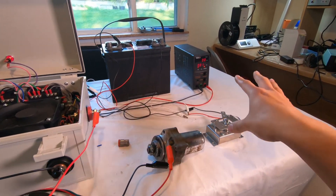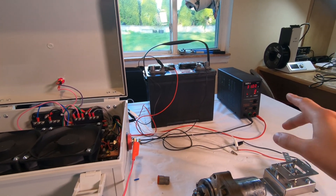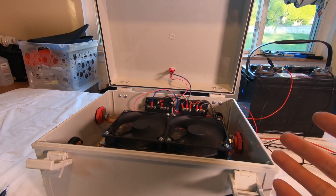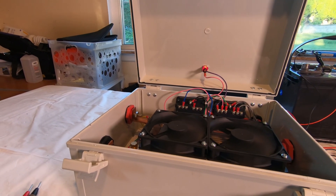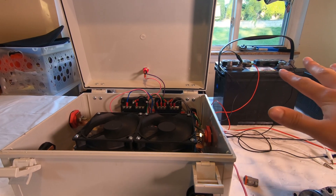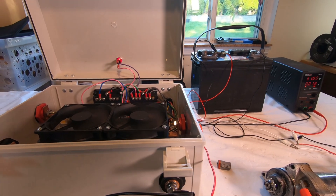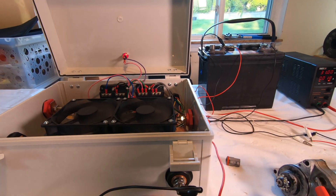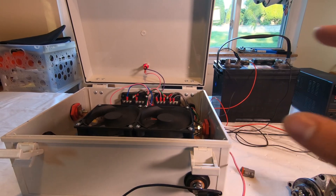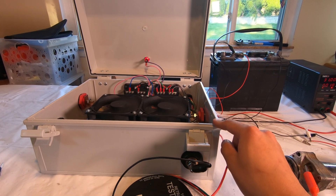Something you don't see here because I don't have two linear power supplies: the whole system draws 0.8 amps when running. When it first starts up there's no significant inrush current — surprisingly it draws about 0.7 amps. So this does not draw much power and won't drain the auxiliary battery much. This wraps up this episode. On the next episode we'll install this motor controller in the vehicle and test it before the full assembly. If you have any questions leave a comment below, and please consider subscribing.